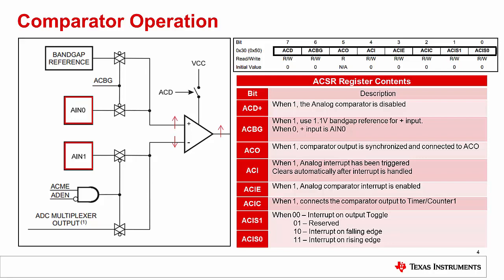Additionally, you can begin looking through the libraries included with the Arduino IDE to understand how functions such as analog read are implemented. Knowing how these functions work can be helpful when you need to configure peripherals in a very specific way. The image on the top right of this slide shows the contents of the ACSR configuration register, and the table below describes the function of each bit in that register. All of these bits are described in more detail in the datasheet for the ATmega328P.